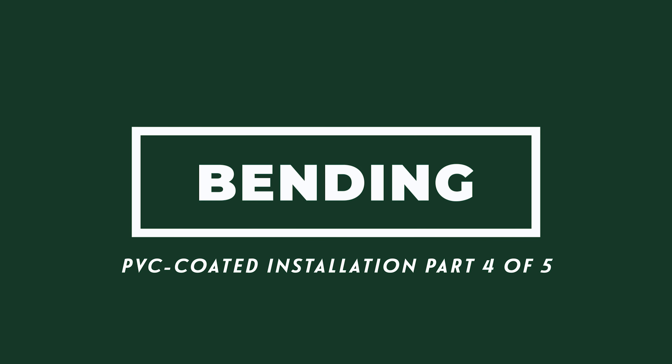Handbending is only available for half inch to three-quarter inch conduit. For optimum results, use equipment specially designed for bending coated conduit. Hydraulic and electric benders are available with shoes sized for PVC coated conduit. When bending PVC coated conduit with powered equipment, use rubbing alcohol to clean the inside of the shoe and the area of the conduit to be bent. Never use a lubricant on the shoe or conduit. Lubricants tend to allow the conduit to slip above the centerline of the shoe, resulting in flattening of the elbow.